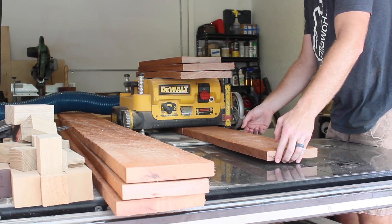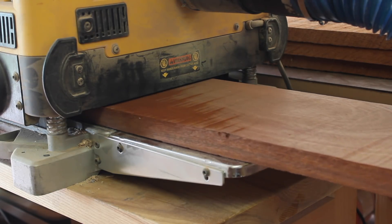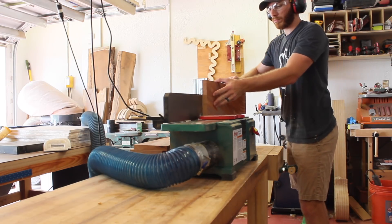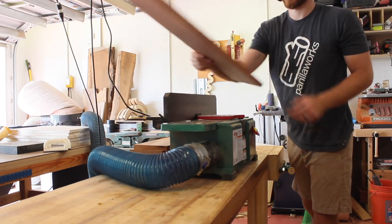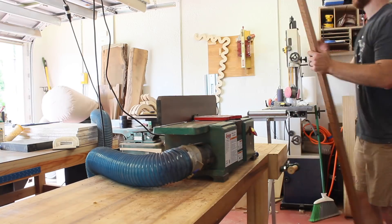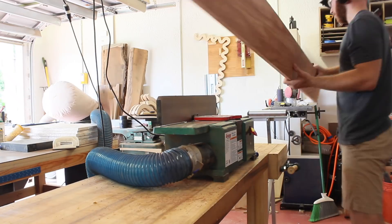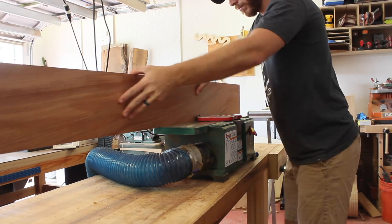I got all of my material chopped down at the miter saw and I'm going to bring it to the planer to get two smooth faces, and then over to the jointer to get some straight and square edges. Small jointers are often knocked because they can't really handle long material due to the fact that the beds are pretty short. But similar to how somebody with a hand plane can joint an edge even if it's a number four plane, you can still get a nice edge with a small jointer. You just have to know where to remove material, and once you get everything relatively straight you can make one final pass that's ready for a glue-up.